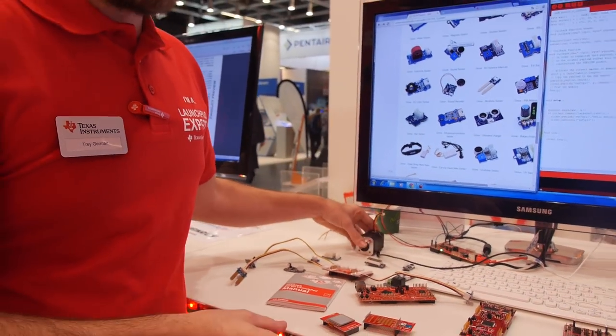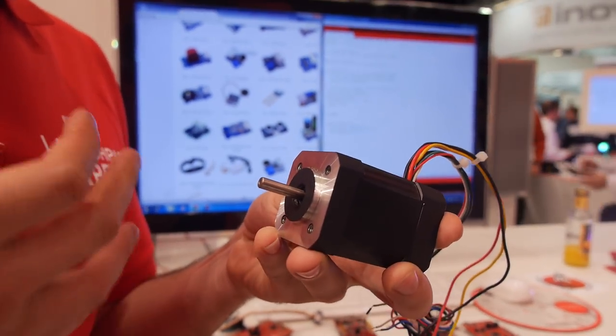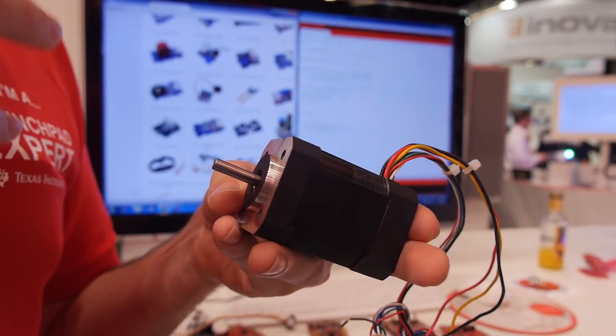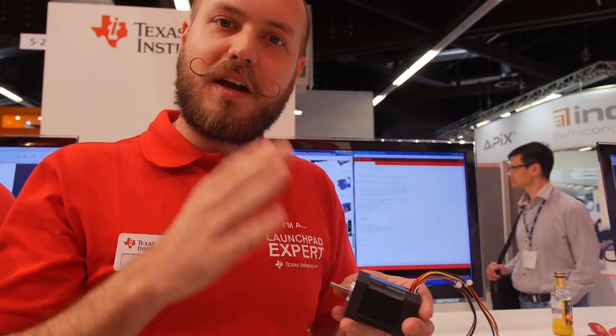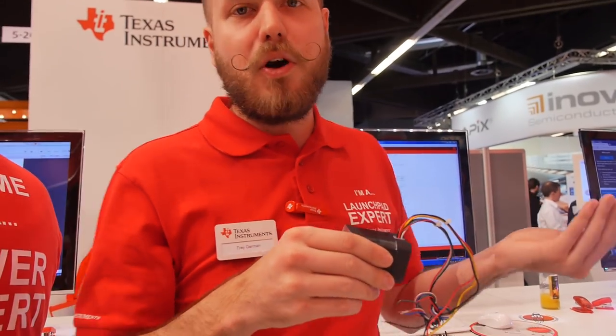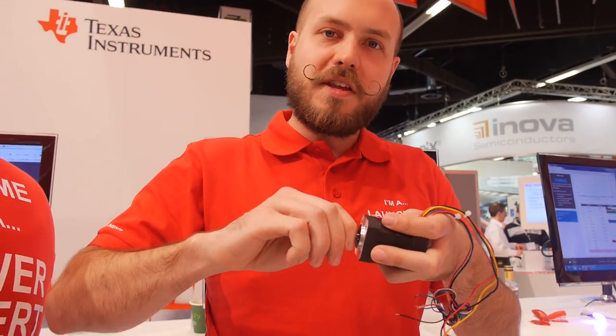What's a brushless DC motor? A brushless DC motor is something like this right here — one of the most efficient motors out there. Instead of having brushes to energize the coils inside the motor, we have stationary coils. That means we have to commutate each of the coils as the magnets spin around the motor, which is typically done with a magnetic sensor inside the motor. Our Instaspin Motion technology allows us to do that completely sensorlessly. We have voltage and current feedback on each of the phases, and using the fast software encoder in the ROM of the device, we can tell where the magnets are in the rotation and sensorlessly commutate each phase of the motor.